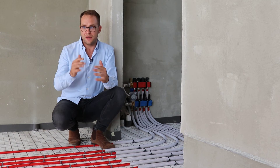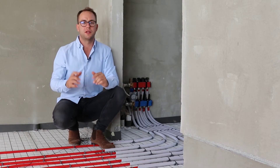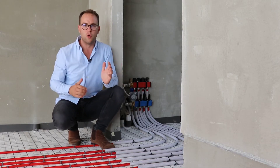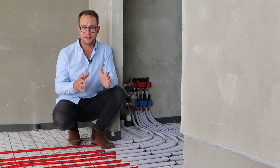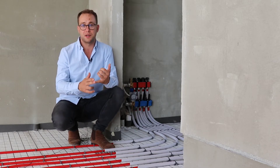So what we have to do is balance it out — that's why we have multiple loops. For example, for this zone in this large living dining kitchen area, we have four loops and each loop is at a maximum of a hundred metres. Ideally a little bit shorter, but at a hundred metres it's quite easy to pump the water through with just a small pump. We can manage the temperature, say 37 degree water flowing through, coming back at 30 degrees, so the floor temperature is quite even with no cold spots and we're giving off enough heat.